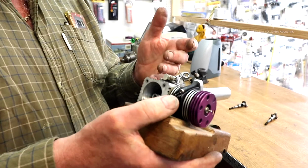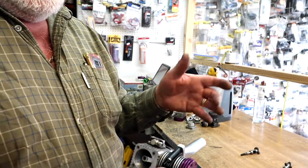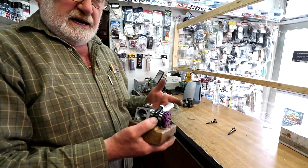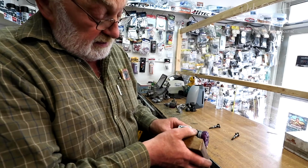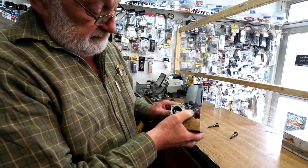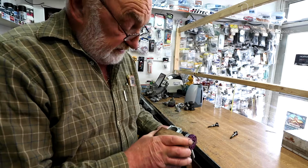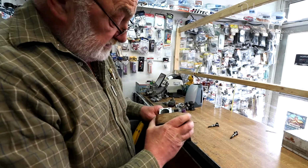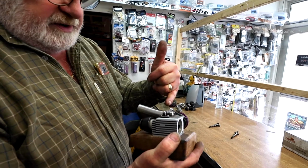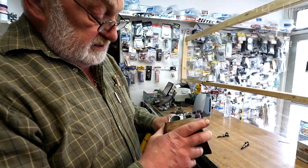If you've got crankshaft induction, you're limited on the diameter. If you've got disc induction, you've got to push it round. If you've got drum induction, you've got to push it round. That crank web is going round anyway to push the piston up and down. Now, the other problem you've got is lubricating the bearing. So, because we're cutting a port on the diameter of the crank web, to balance it, we've got to take out some more on the other side.